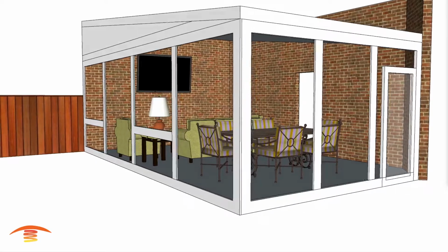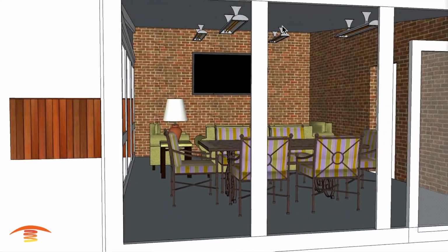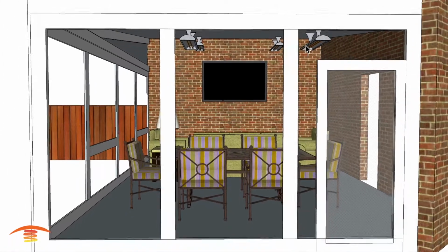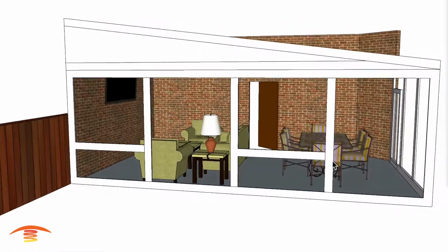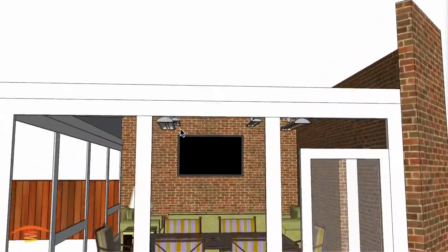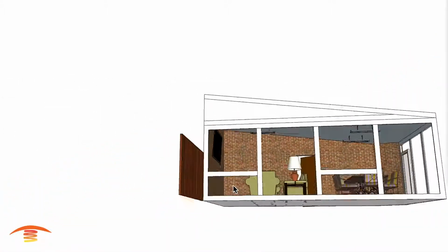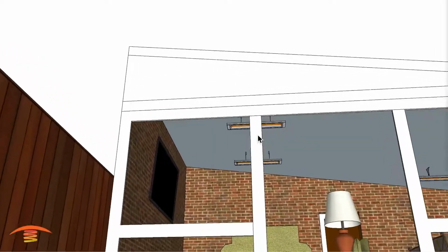And this would be my first preferred option, which would be utilizing 4 of the 5,000 watt units. Now I have them 6 foot center to center on each unit. I have them centered. What I did was cut the space in half, and this is the other half. And then I took the center position there and placed the heaters centrally located right there. And then also, again, from this point here out to the center of each heater, 3 foot, or 6 foot center to center on units. And that's true over here. Same thing, half of the space, cut it in half, and then position the heater right down the middle there.